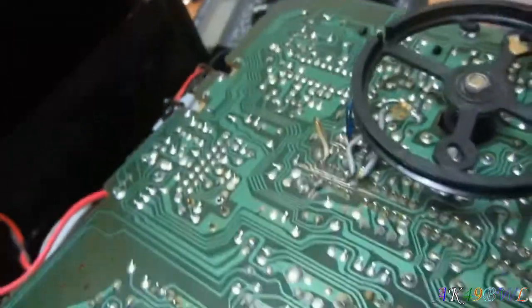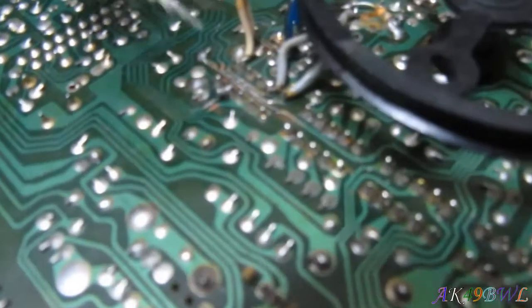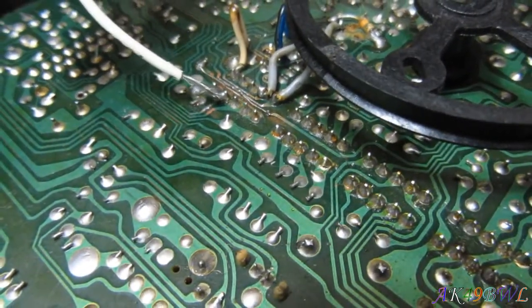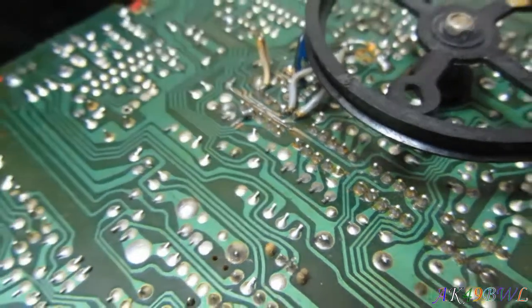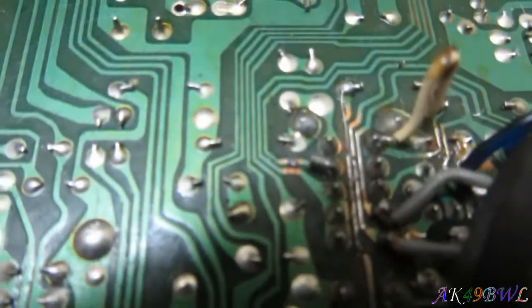I don't understand you. Okay, I had a wire here I was using yesterday. There it is. So, I figured maybe there's something wrong with that trace. So, I just stuck a little wire between that trace and this up here. And that consistently works. So, I'm going to go ahead and solder in a wire right there, and just bypass this little mess of a trace right here.